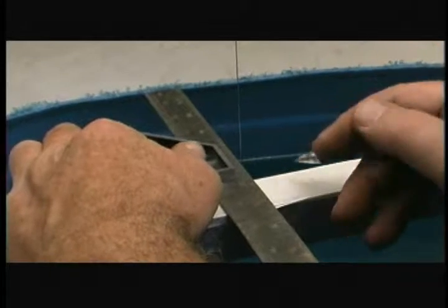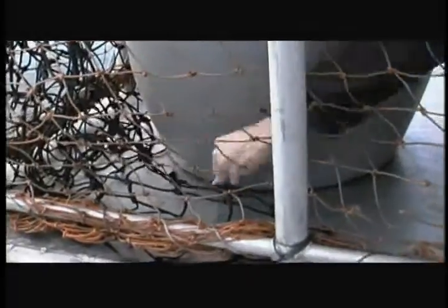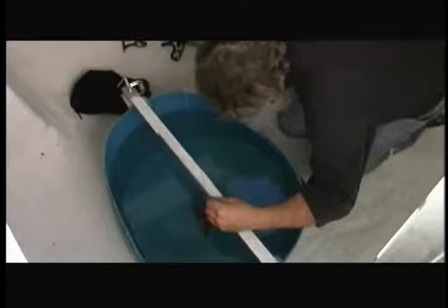A scale is situated beside the plumb bob. With the vessel in an upright position, the plumb line should be directly over zero on the scale. Weight positions are marked on deck. These marks allow for measurements to be taken and factored into the formula for calculating GM. Each time a known weight is moved through a known distance, the deflection of the plumb line is measured.